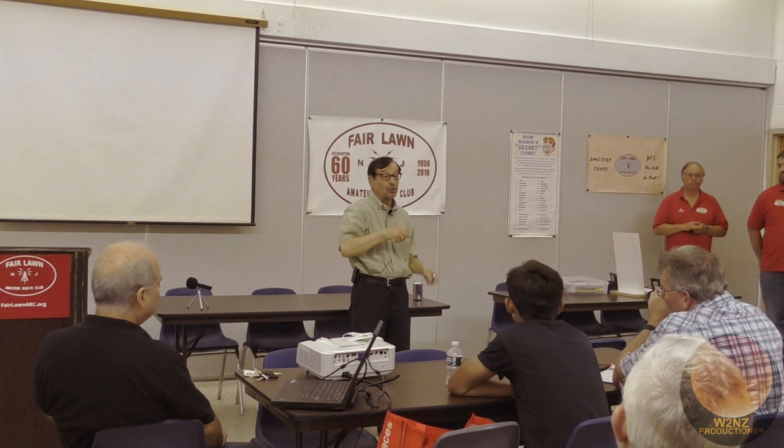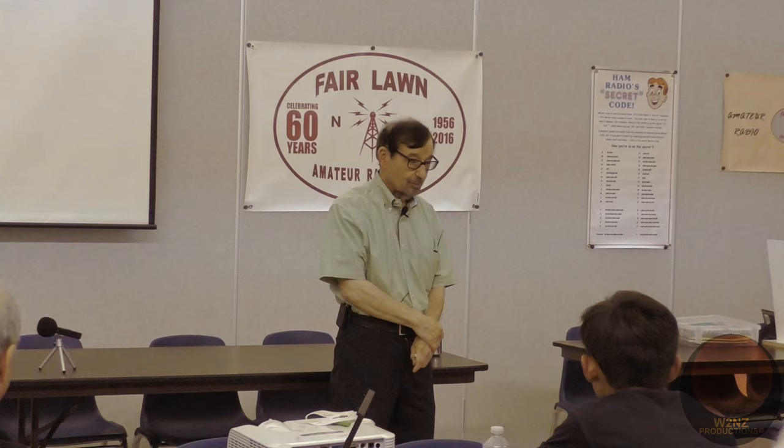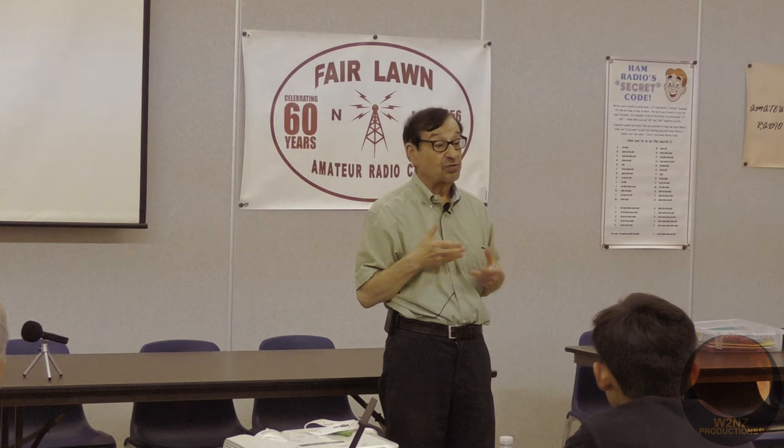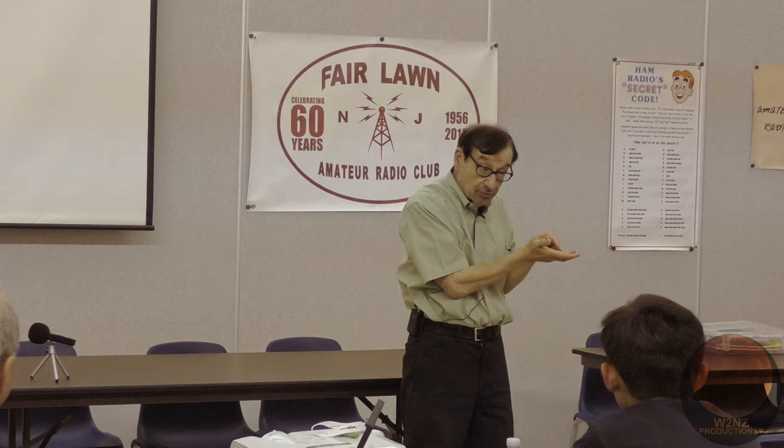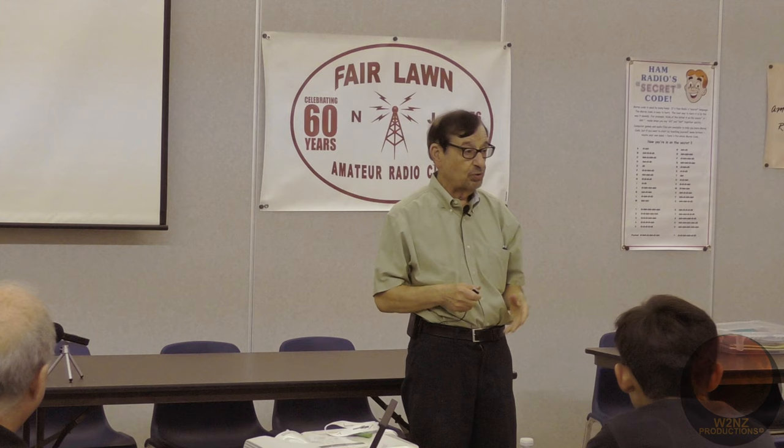Two things that overlap. You mentioned the surface of the moon creates some noise, and you were talking toward the end here about the noise floor. What is the typical noise floor that you hear? On 1296, well, I can't talk about a noise floor because there's a bunch of factors that go into it. The noise floor is made up of the noise that your receiver adds, and then the noise that your antenna picks up on top of it. And the reason that the moon generates noise is because it's not cold. The moon has a core temperature, and you can see that core temperature.